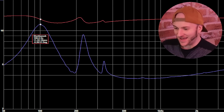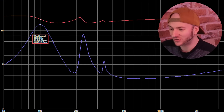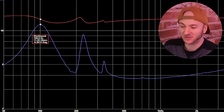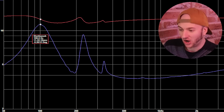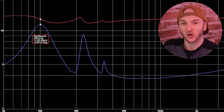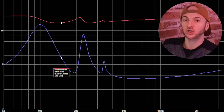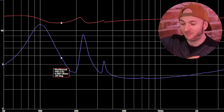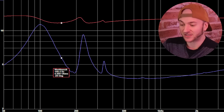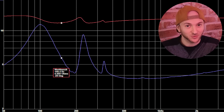What are we looking at here — a very spiky looking graph compared to what we're normally used to seeing. Starting from the bottom: we have a big unload down at 100 Hz, pretty much on the nose. That's where none of the box is loading the cone whatsoever, and it's getting close to being run in free air at that frequency. That's fine because we're not playing 100 Hz. The lowest frequency we test is 150, and at 150 we're about two-thirds of the way down the slope towards the impedance null — 5.6 ohms. I think that's actually going to give us a reasonable amount of excursion but still reasonable loading and displacement from one of these ports.